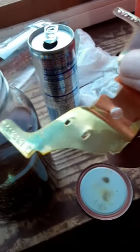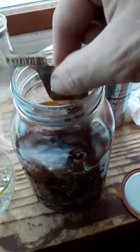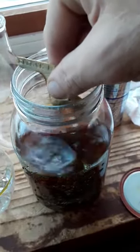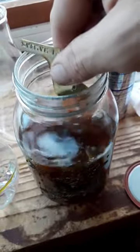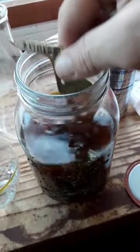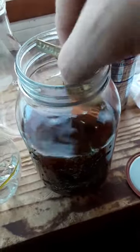So now what I'm gonna do, just to show you how quick this stuff works. See the difference? Here's the copper and here's the gold, ready? I'm just gonna do this, swish it around, because you have to exhaust the solution to make sure it can precipitate no more gold. If you don't exhaust the solution, you're gonna have a really hard time getting the gold to come out. Look at that. The gold is almost gone.